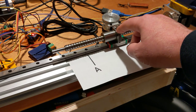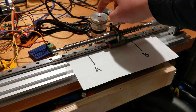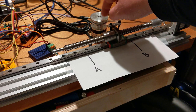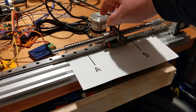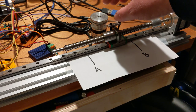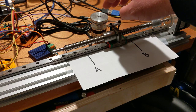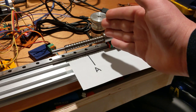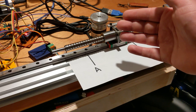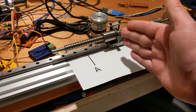The other factor is, you also want to make sure that you're sending the commands frequently enough, right? You probably already have your encoder on an interrupt, but in this case, if you're mapping to the velocity, you have to have some interval that you're using to calculate the velocity, because velocity has a time component. So if you're checking your velocity every 100 milliseconds, you'll issue the command. The command might actually be done if you're only moving a very short increment, and then there's nothing in Grbl's planning buffer anymore, so you haven't sent another command in there, and that will result in a jerky motion.